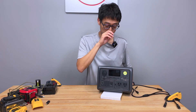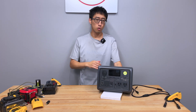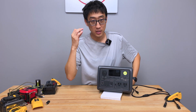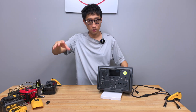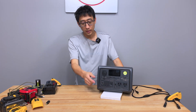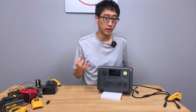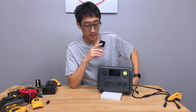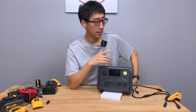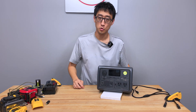Why would you want to do that? This one has a 600 watt inverter but only has an internal battery capacity of 268 watt hours. So 268 watt hours with a 600 watt inverter - you do the math - it's not going to run for a long time, especially if you're drawing a lot. You can connect solar panels and do all kinds of stuff, but the way we want to do this is use the solar charge input, which will take up to about 200 watts. If you draw 600 watts on a 268 watt hour battery, you want to inject more power into it so you can run longer.